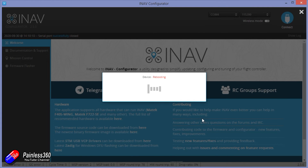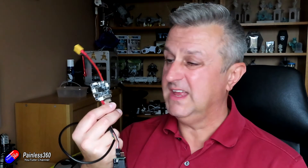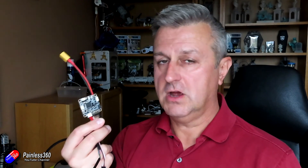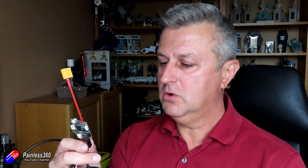Those are the main things you need to do in iNav. The vast majority of it is around how to handle the bi-directional ESC — that along with the radio settings I've shared in the link below should be enough to get us ready to pop it into the boat. That's probably as long as we can go for in this video. Next time we'll put the electronics in, do the final setup, and go out and test it on the water. Make sure you've set up the flight controller as you normally would in iNav and made those changes around the reversing ESC and the throttle value around 1500.